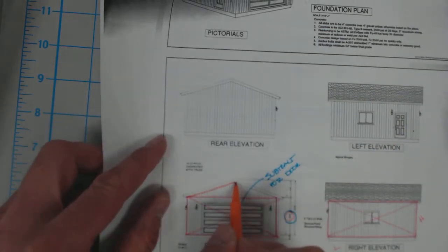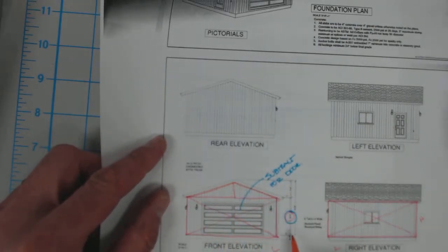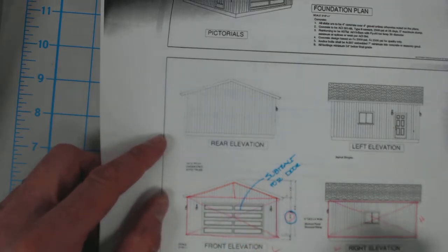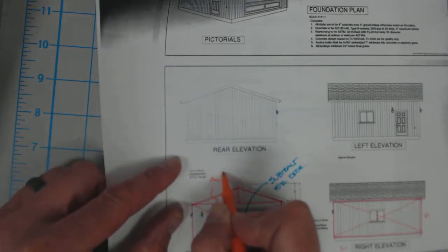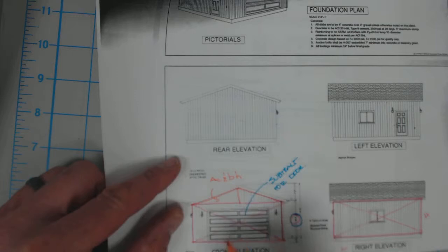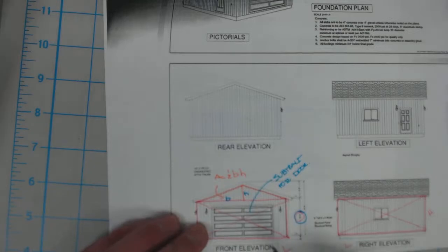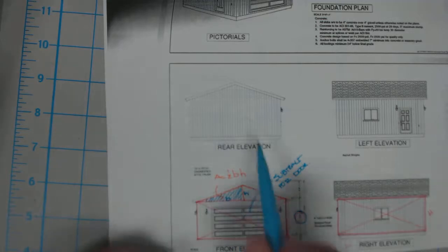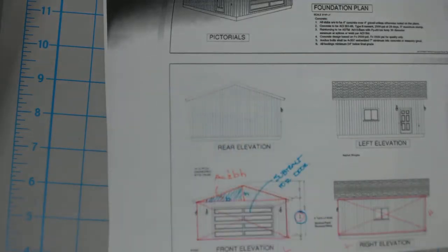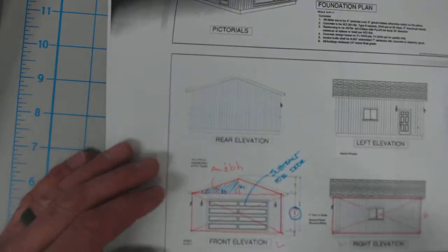We don't want to do that for the wall framing labor, but we want to find the triangular area too. So we've got to find the length times the width of these areas, plus we need to find the gable area. And just as a reminder, the area of a triangle equals 1/2 of the base times the height. So if you've got your base here and your height here, you can find the area of one side of these triangles. And we'll have 4 of them by the time we're done using that equation. So we do need to find the total square foot because we will be sheathing this. We don't have to account for it in framing yet because we'll be using gable end studs. So sorry if I made that a little bit confusing.